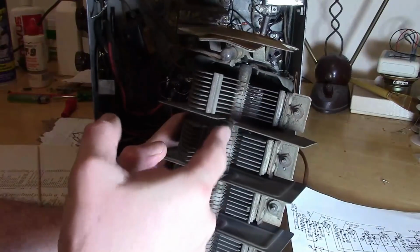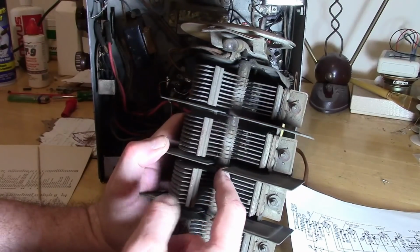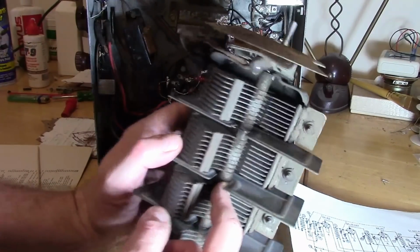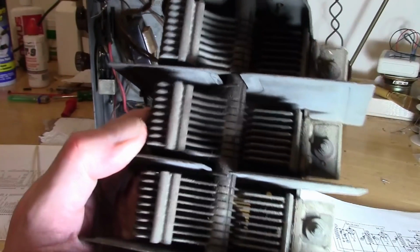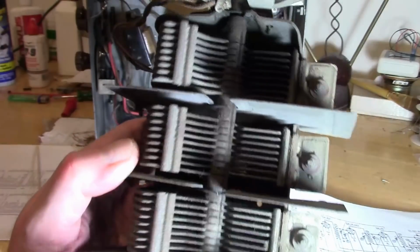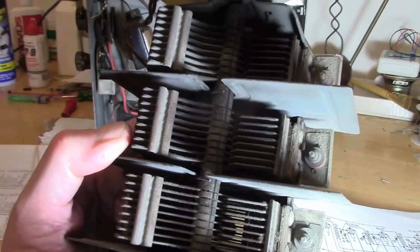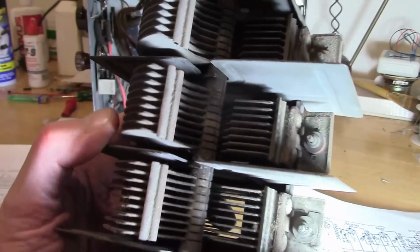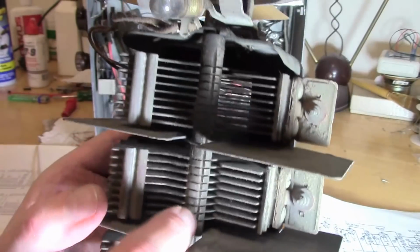And that is because they have a common shaft, and there are wires, very stiff, spring steel probably, wires that rub against that shaft. If you have a radio that crackles or does weird things while you tune it, that's something you might want to check. Spray some DeoxIT in there. Clean up the metal on metal contact.